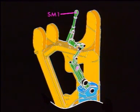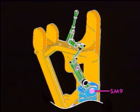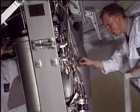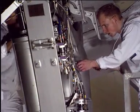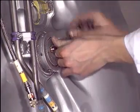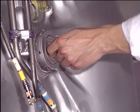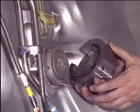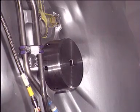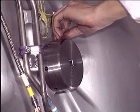SM1 is the interface in the wing and SM9 is the final pin in the capsule. Unscrew and remove the two grease points. Install the appropriate tool on the collar. This collar secures the shortening mechanism pin SM7 to the main fitting.